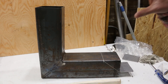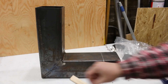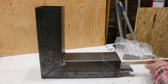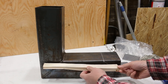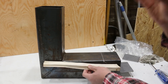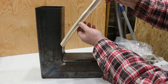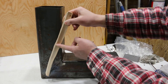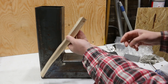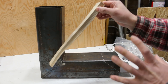After testing, I'm not a hundred percent happy with it so I'm going to modify it. I'll cut this back to about here, keep this as the air intake, and cut a slot so I can feed wood in down this way. Right now the wood only comes back this far — air sucks up from underneath and it only burns about this much of each piece, which doesn't get hot enough for a wood-fired oven. Feeding wood in this new way I'll still draw air from the bottom but have longer pieces burning vertically, still getting the stack effect but with more fuel burning at once. So I'm going to start modifying it.